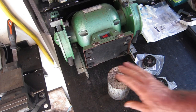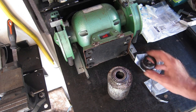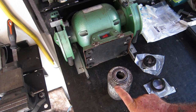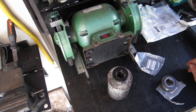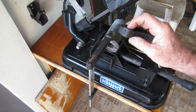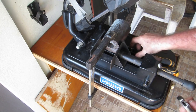So what we're going to do is cut this thing up. I may be cutting things a little fine here — this is the bearing and seal for the bottom, and I really need about a 10mm ring around the outside which I'm not really going to get. The other end is not so much of an issue because it's a smaller bearing. Anyway, we'll go and cut this up first and then get on with machining it. Also, the clamp I meant to use earlier — the bloody Chinese thing split on me, but it's got two nice flats so I can get a shifter on there.